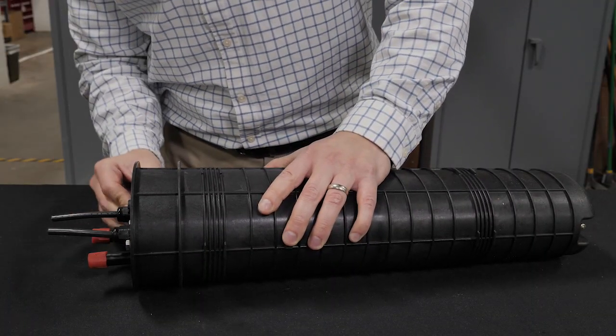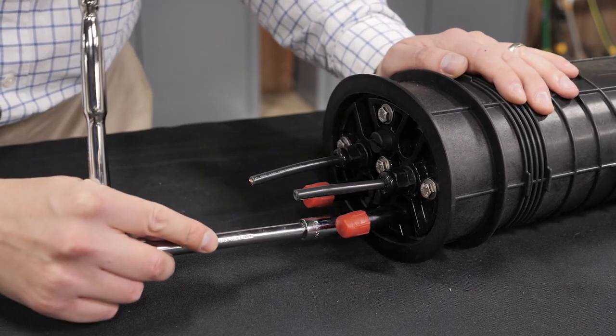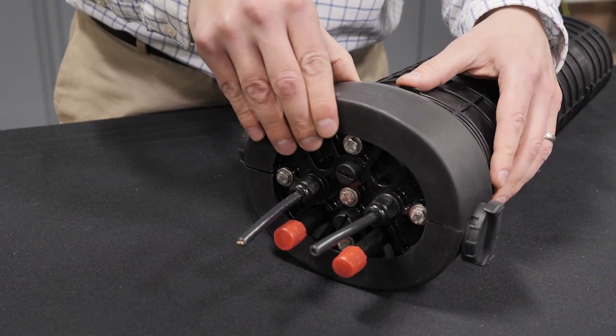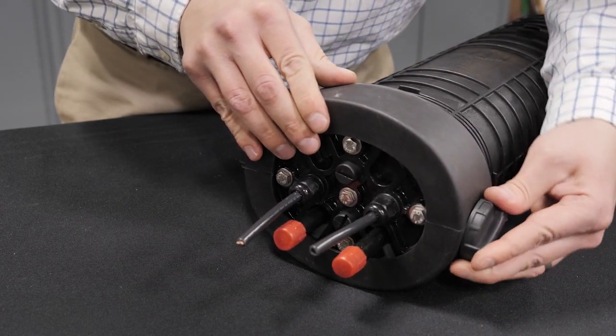Install the platform and seal assembly back in the dome of the enclosure. Re-tighten the bolts on the outside of the closure per the included instruction manual. Install the collar onto the base of the closure housing and turn the collar knob clockwise into the over-center lock position.